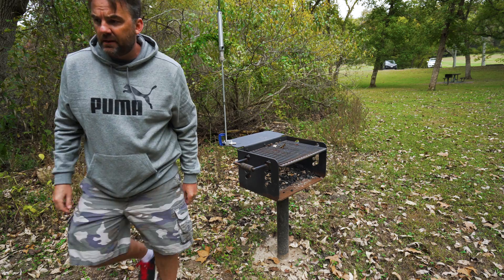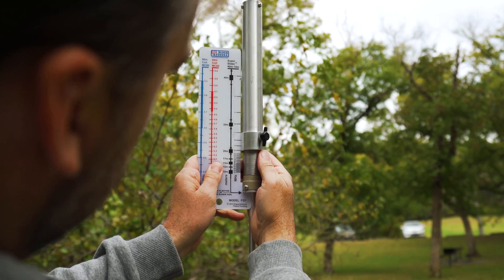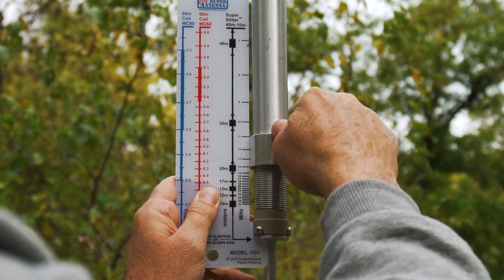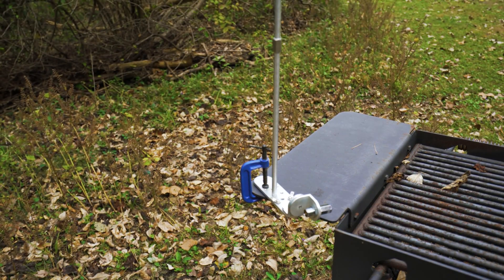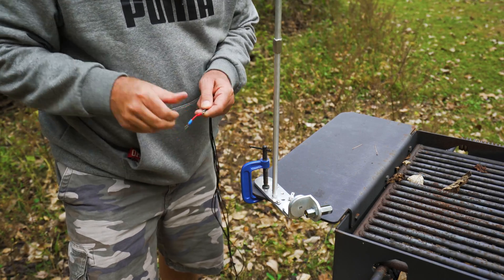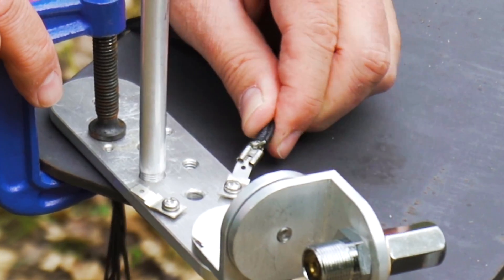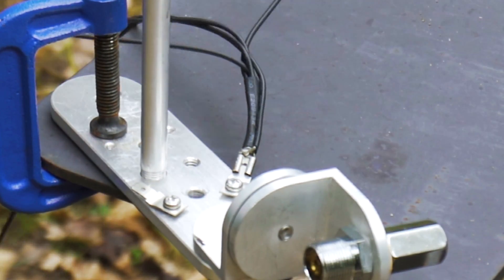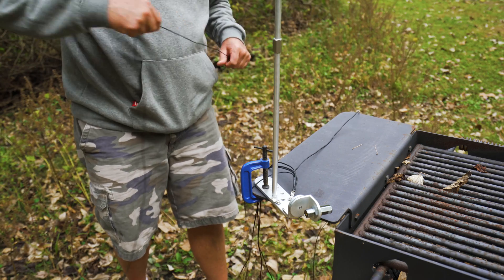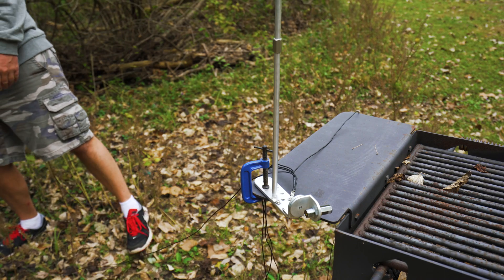Let's start at 20 meters — 14 megahertz. That's right there already. You bring it up and down, but I'm going to use the antenna analyzer to make sure. Now I've got the ground radials, which are quite a twisty mess, and I've been using this for other stuff. I'm going to plug this in — should plug right on there like that. Now let's spread these out. This has one that's like 20-some feet; that's the biggest pain to deal with as far as tangles go, so I'm going to try to spread them in all different directions.